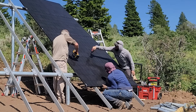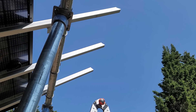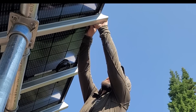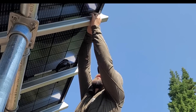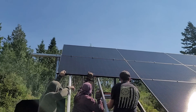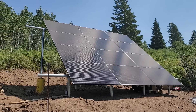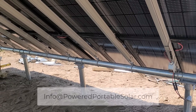On the bottom rows, the bolts are really easy to reach. Once one panel is in place it's locked in, and on the bottom we use what are called camo clamps. These slide into the top groove of the rail at a 90-degree angle until you're ready to secure the panel — then you twist them into place with a lot of force, and once in, they're locked. The UFO clamps between the top and second panel clamp down to hold everything together and make the whole array more rigid. The final product has the bottom rails cut, everything lined up, with extra pipes sticking out on the left and right intentionally in case the customer ever wants to extend the array.